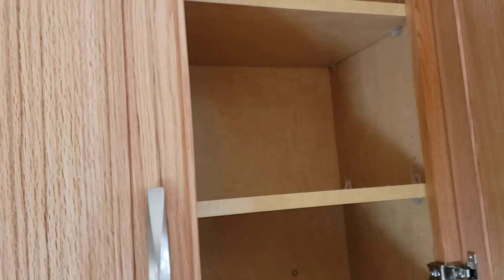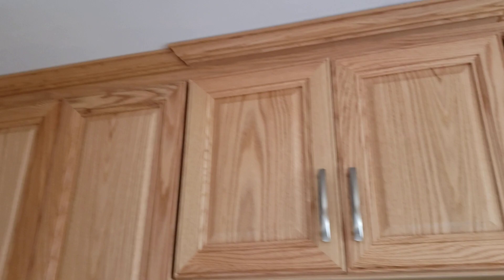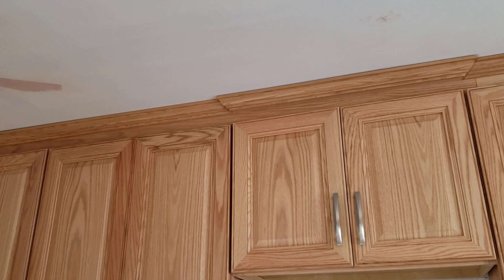That upper cabinet is huge — you're going to put all kinds of storage in there. Adjustable shelves, slow-close doors. We went ahead and cut in for the electrical for the microwave. We did a capital cut in the top molding as an accent above this area. That keeps me from having a seam in this length — it's over 10 feet and they only make crown in 10-foot lengths in this finish. So we stop it, jog it, go back, and that gives a focal point right above the stove area where the seam doesn't show.